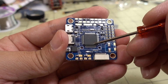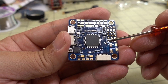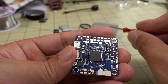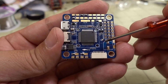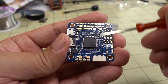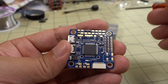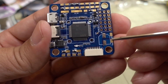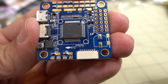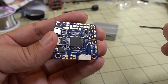There are going to be some other boards out there like a 9-volt, 2-amp regulator — that's a pretty common one. And that's going to be 9 times 2, which is 18 watts. That should be fine too. I think people say that this will probably draw as much as 16 watts, so you probably want at least that much to cover it. Now if you don't have a voltage regulator on here at all that's going to provide that, and you're only going to run this on 4S, then you can just run it off of the VBAT pads here. Obviously if you're using 6S, don't do that because you'll fry the air unit.